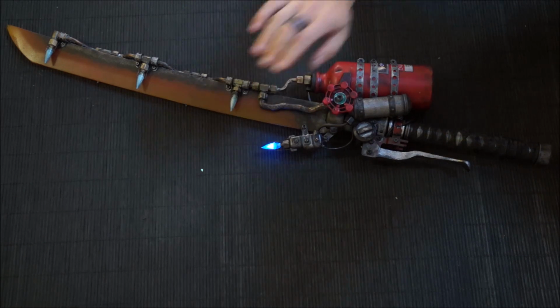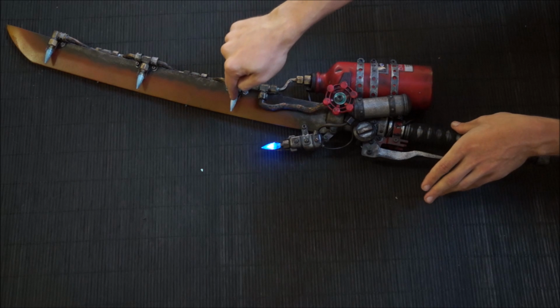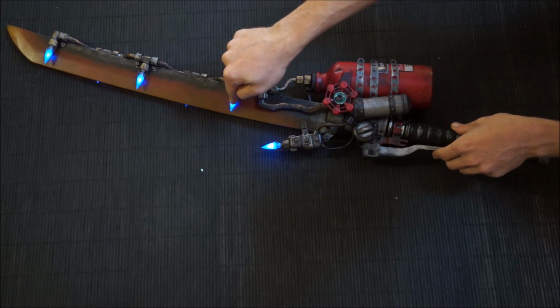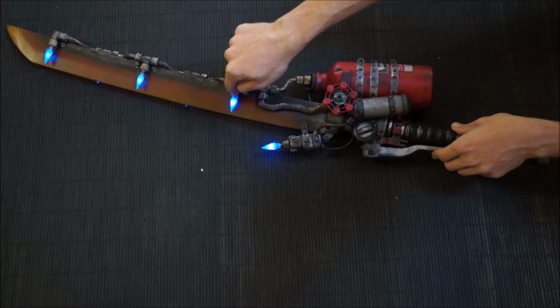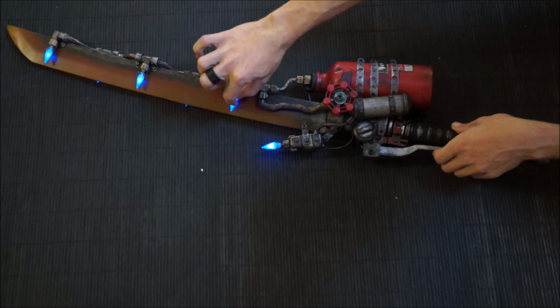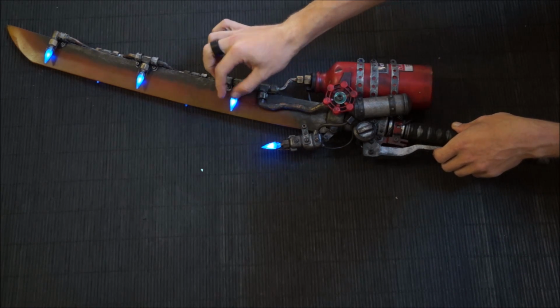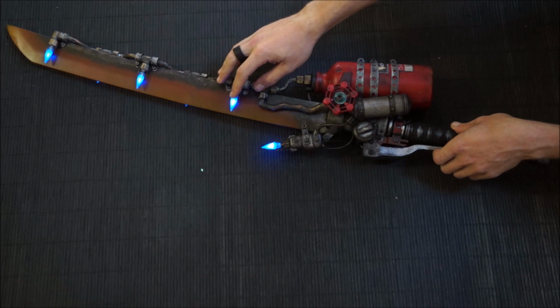Now, the way these systems work is they're specially 3D printed tips that I made, so that way I can have an LED sitting in front of the output of my fluid system and yet still have fluid run around it. There's 2 3D printed parts that are glued together, and there's this little suspended capsule that the LED is locked into, completely isolated from flow.